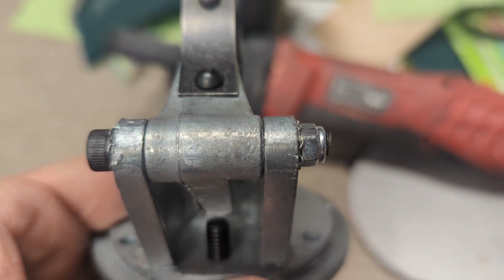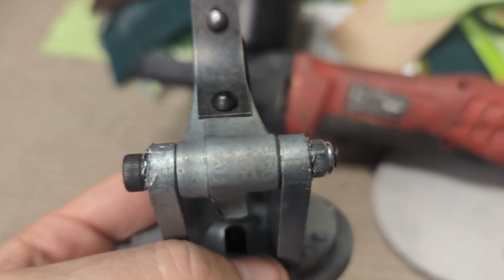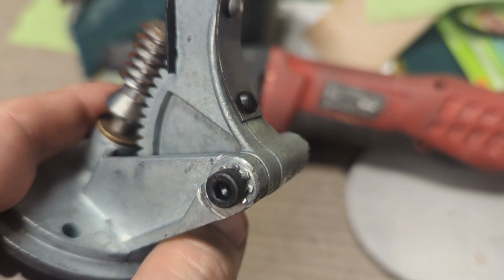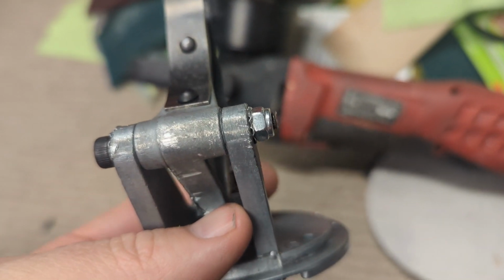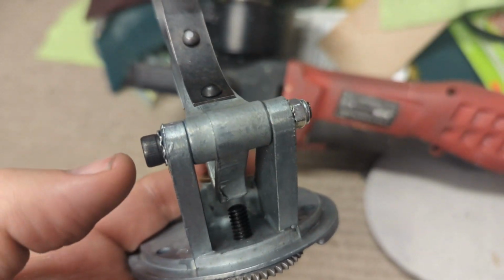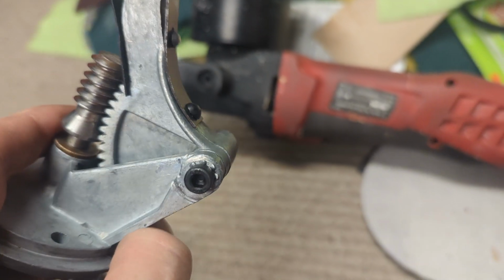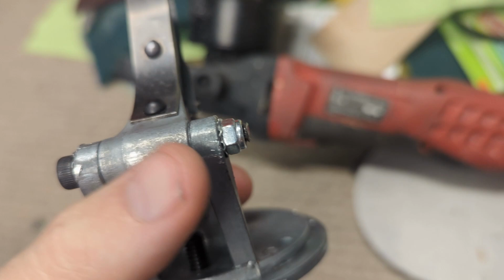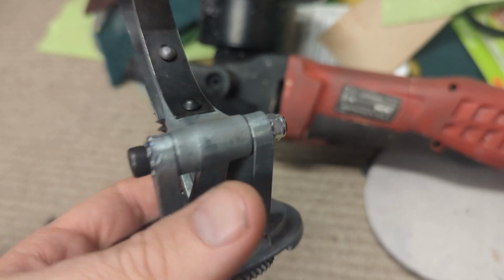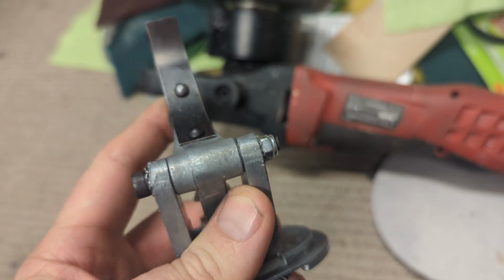I've put the speed control back together and I did the modification removing the roll pin. I ended up using a 6mm or M6 screw. I had to drill out the quadrant a little bit. Apparently the holes in the arms here were worn out a little bit, so by using the M6 bolt and then some star washer locking washers on each end, now it rotates fairly easily.